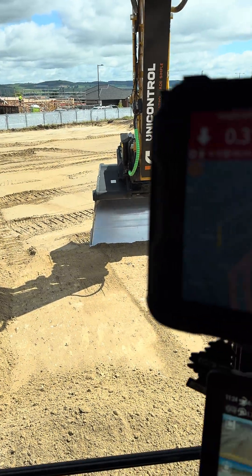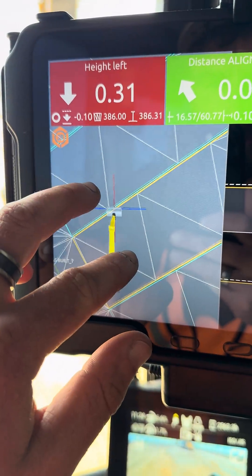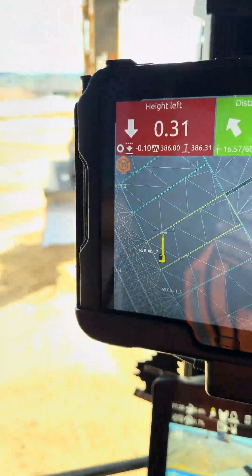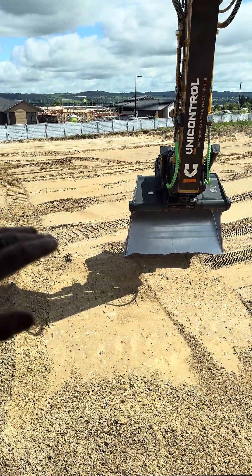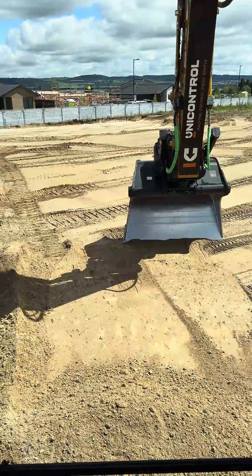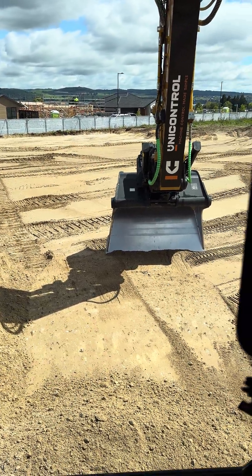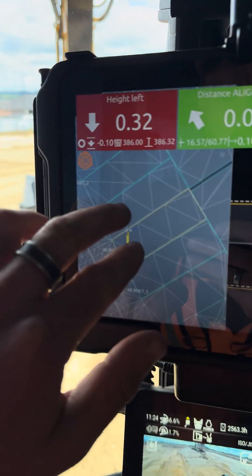It's easier to throw all the spoil to the machine that's loading out, then I'll trim my way back down the hill. For anyone who runs machines, when you're cutting out pads that have got terraces between them, the easiest thing to do is to over-trim the top pad past where it's going to step, then cut the next one below it and take the material down with you, so you get a nice hard clean level line between the lots.